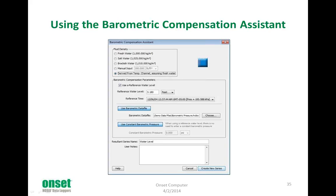There's a question: does the barometric logger need to be at a particular elevation in comparison to the other loggers? It turns out, because of the way the math works out, that the elevation of the barometric pressure logger versus the other loggers really doesn't matter — it just gets normalized out. As long as the barometric logger is staying at the same elevation during your deployment and the loggers in the water are staying at the same location, the elevation difference doesn't matter. For a lot of our testing, we have a barometric pressure logger at our building at Onset, which is about 60 feet above sea level, and we use that to correct data for water level loggers that are at sea level — the math cancels that out.